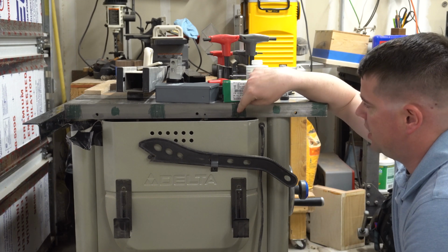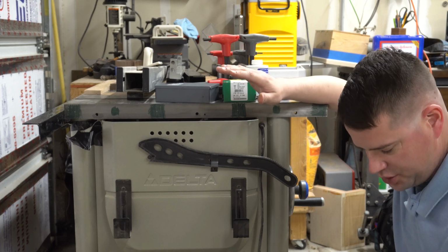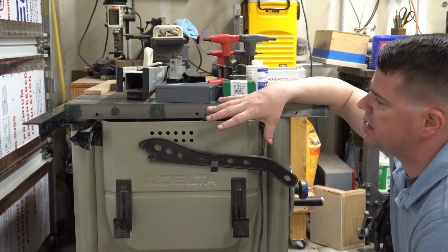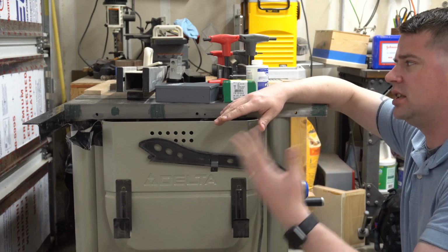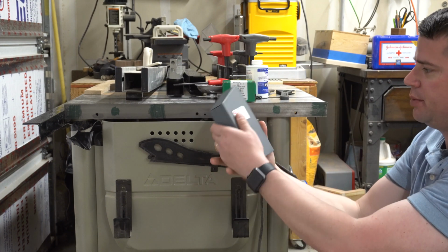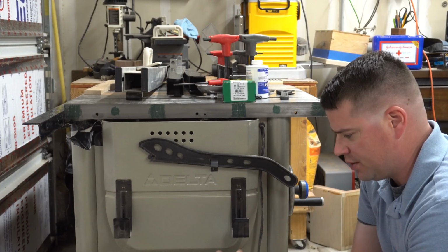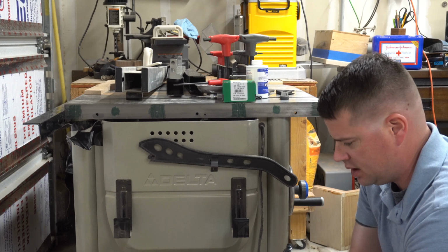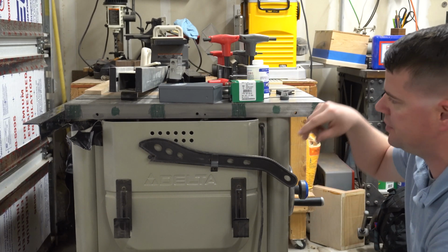To tap the holes for that size, you needed what it said was a Q drill bit. I didn't understand what that meant. So doing some more research, I guess you have standard, metric, wire gauge, and letter-based drill bits. So I got a set of drill bits from McMaster-Carr as well. I've never ordered anything from them before, but it was here from somewhere in Illinois in 2 days. So now I got those. I got the Q, and I got a bunch of other letters too.